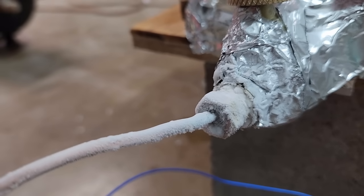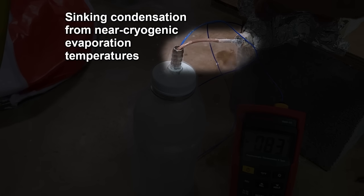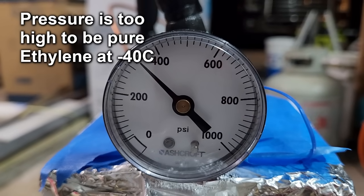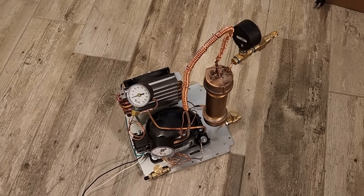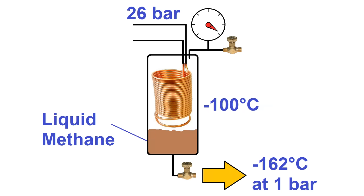I think I bit off a little more than I could chew, so this project is definitely going to need a part 2 video where I correct some of my mistakes. It's not a total loss though. I did technically achieve cascade refrigeration, even if it was open loop and only for a few seconds. You can clearly see from the frost and sinking condensation that we had an extremely cold liquid evaporating and not just cold gas being blown out the pipe. I also got enough information to verify that my ethylene was indeed impure, causing it to require a higher condensation pressure, meaning the next batch will need to be made with a lower catalyst temperature. My little condenser unit also proved to be very useful, and demonstrated that ice makers are a nice cheap way to create a small vapor compression system. Going forward, I can use this thing for making dry ice, since I should only need around 130 psi to condense CO2 inside my chilled pipe. In the next video, I'll attempt to make ethylene of a higher purity and optimize my second stage a little better to hopefully get a cold side temperature of minus 100C. Once that can be achieved repeatably, it won't be much more work before I can start making liquid methane and then liquid nitrogen.